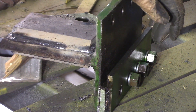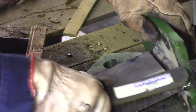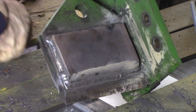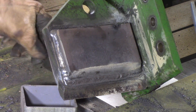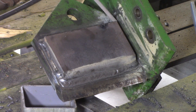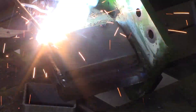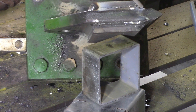I'll clean them up and have a bit of a think, because the reality is that all the pressure is going to be on here to peel - all the peel pressure will be on here. Probably should put another weld down along the back for the shear - that'll help hold it anyway. I think that'll do as a second stage on the front. I'm going to put some more weld along these back corners. I'll put a heavy weld down along that back corner. Just for neatness sake, not because it needs it.